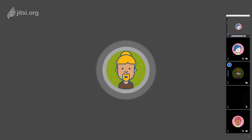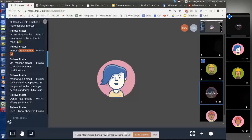Okay. Well, maybe there could be a different logic or function or something. Okay. So there's different logics we can use, and that made me think, well, maybe that's why. Like when we did the code, because I know when Zach did it, he had a bunch of case statements and a little bit more complicated Arduino construction. In this thing, all we tried to do, because I want any user to be able to modify this code, is sense sensor, move cylinder. Like no funky loop constructions like case statements. You can get advanced with the code syntax, which is the so-called proper way to go, but you can also make it very simple where it's very linear and structured very simply, namely detect and move, with no special constructions of case statements and so on.